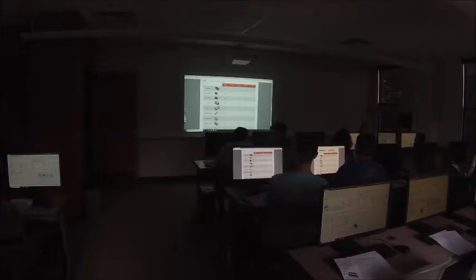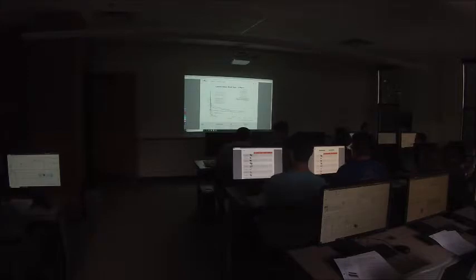So if we go look at the 775 Pro motor, we go to the locked rotor stall test. You see this graph? This looks a lot different than the SIM, right? The SIM at 12 volts, which is the green line, failed about here, about 35 seconds. At 12 volts, the 775 Pro fails here, like 3, 4, 5 seconds.